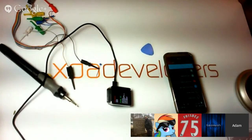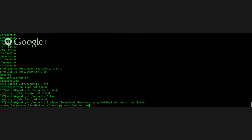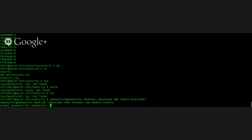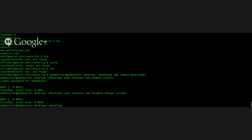All right, so sudo, let's see if this works here. Sudo fastboot OEM enable console. Okay, we got console enable. All right, and let's do sudo fastboot OEM disable charger screen. Okay, and now we can do...